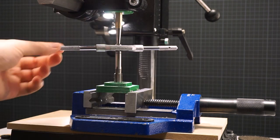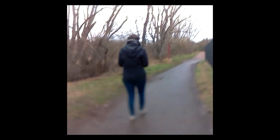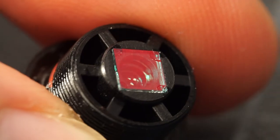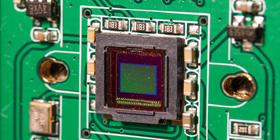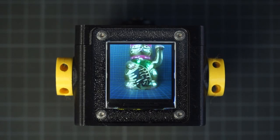You never know the actual quality of the lens before you buy it — there are very few standards, but it's a lot of fun. Keep in mind, not all M12 lenses come with an infrared filter built in, so make sure to get a camera module that has a reddish-purple tint — that's how you see if a filter glass is in front of the sensor. I wasn't exactly sure what to use as a display, so I made one camera with an old viewfinder and a second one with a tiny square display meant for cheap smartwatches. It looks pretty weird, but works well.